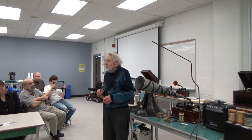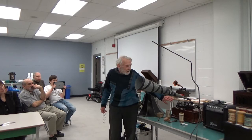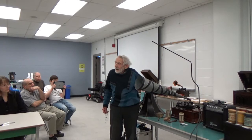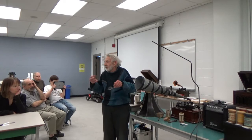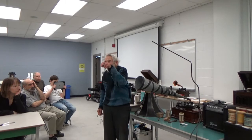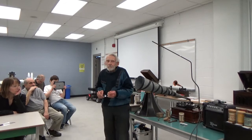So if you're going to do it, one way that you can heat up your cylinder, and I didn't want to do that today because it just takes forever to make a record, is to put the cylinder on the mandrel and put either a heat lamp or just an ordinary lamp on it, with the mandrel turning so that you're not heating the cylinder unequally. You don't want one side of the cylinder to be soft and the other side hard, because it'll make a poor sound, since the stylus will gouge. And the stylus is sort of like a potato peeler in a way. It's actually a curved thing that goes along through the wax like that and scoops it out in little tiny sort of spirals. And so the heat lamp will soften the cylinder equally.